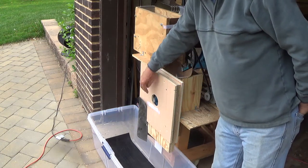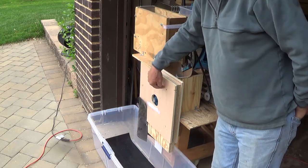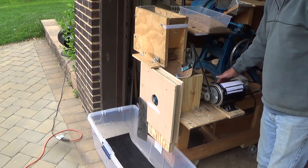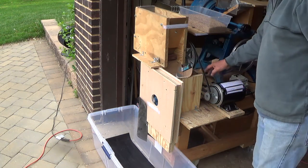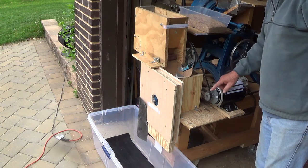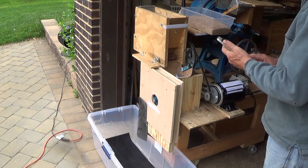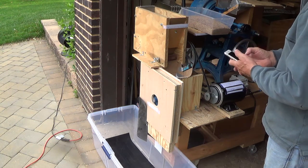We have an impeller here. Inside here is a ring — a polyurethane that the rice will hit. This is a feed hopper that we've used in the past because you've got to control your feed rate. We have a quarter horsepower motor running at 1,725 RPM. The impeller down there runs at twice that, but because of losses it's running at about 3,200 RPM. I've got a pulley here and a pulley here to do the feed. I have four pounds of rice.